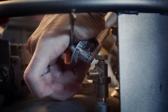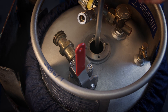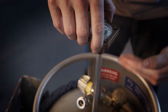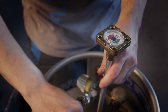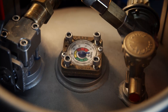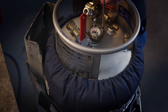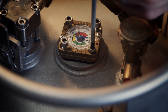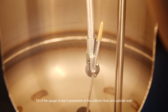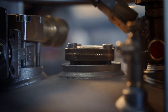Make space here, bend a little bit, and press in. Now we have to orientate the gauge so that the bottom part is moving in this direction on this side of the bottle, because on this part there is a tube on the bottom of the cylinder. Put bolts with Loctite and tie the bolts. In this moment this surface starts to be a little bit tilted and you can see the rod is moving to the right side. Finish tightening the bolts and use the torque wrench.